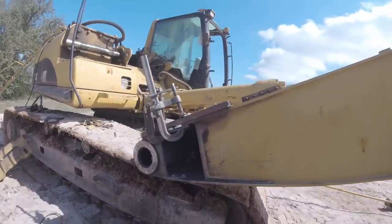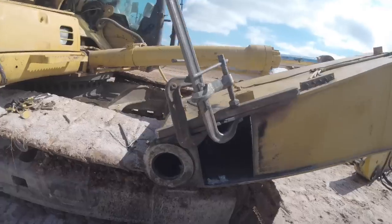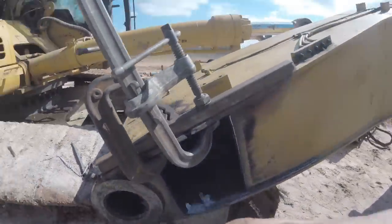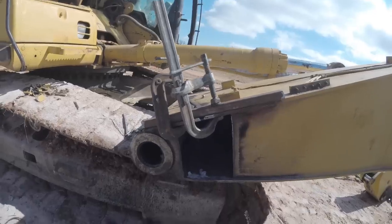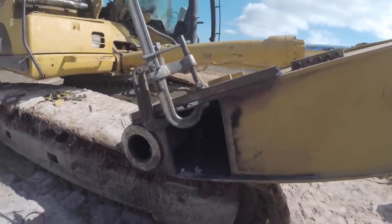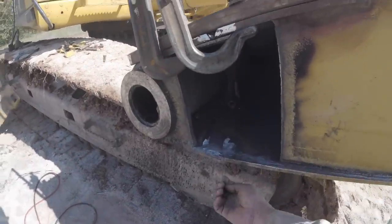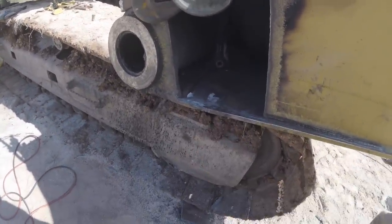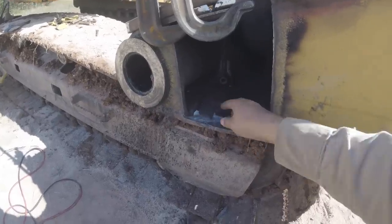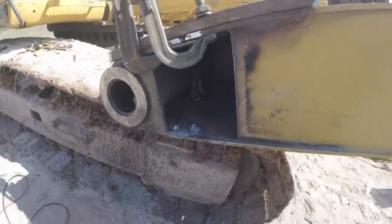Okay, so I almost forgot a couple steps here, but hopefully I can catch up to speed. Basically, this had popped up a little bit and was out of line, so using the clamps here with that bar to hold it straight, I welded this up here from the inside, and I'll have to do some cleaning from the underside when I flip it over, but that's no big deal. So this is almost like a root pass, starting with the root first for the backside. Kind of weird. Either way, it works.